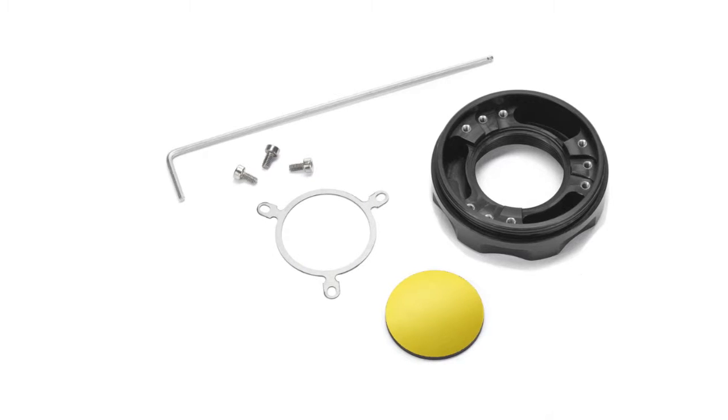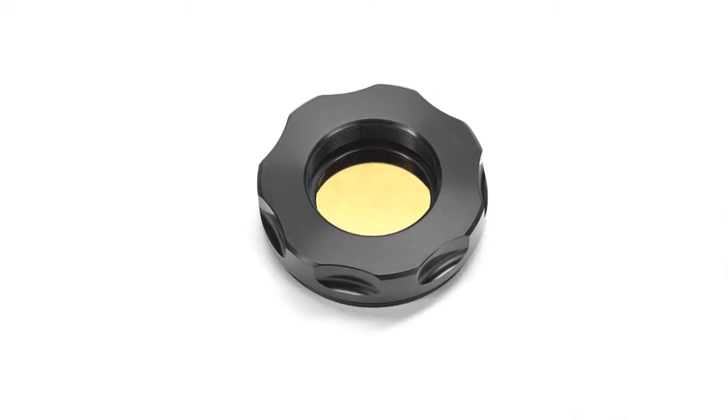Basically this illustrates the fact that if you know the different spectral properties of your products, then you can select the right bandwidth of your filter to identify these different products, right? Yes, that's exactly correct. You would have to look at the materials you have and record the spectral information offline, and then when you really look at them closely, you can find a good position for your filter. There are filters available over the whole infrared spectrum, so that's really not an issue. And then you can select the correct one and distinguish them with the filter.